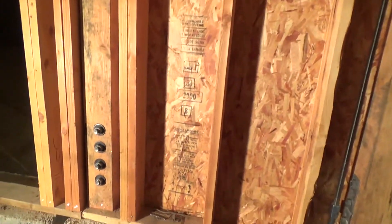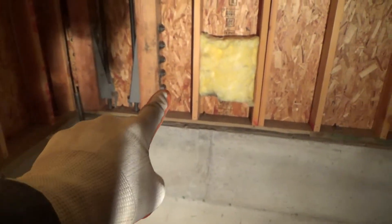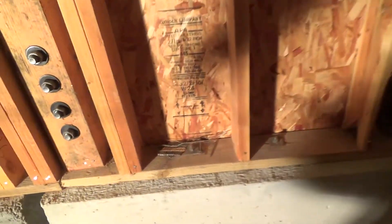So I was looking at that and thinking I'll have to put some two-by-sixes in there and cut them. See how they V-cut that? There's a foundation bolt right there, and there happens to be another one right in my way for where this goes down. I'd have to notch out the two-by-six, and I don't really want to do that. There's another foundation bolt here — one, two, three, four — and there's probably another one over there. You don't have to have them that close together.